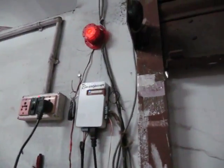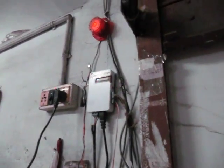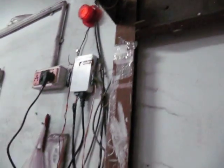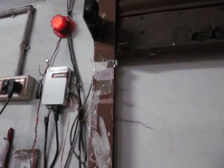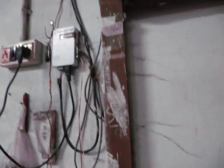This is a very good safety feature in this remote receiver. When the rolling shutter is going down or the sliding gate is closing, if somebody comes in between the photo sensor, the photo sensor will start operating — the alarm light and sound will activate, the shutter will go up automatically, and the sliding gate will start opening automatically.